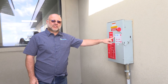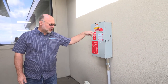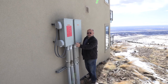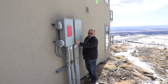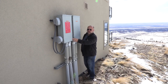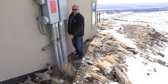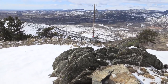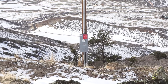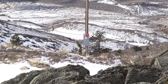This is currently a single disconnect for the entire system. As I mentioned, we're going to split this into two and put another switch here, then run twice down into the basement service panels. On the outside of the house you can see my two service drops, 200 amps each. These go underneath the floor into the utility equipment room. You can see the supply for these 200 amps each goes underground out to the pole. On the pole is my service meter — you can see the two services coming out of the bottom of the meter set and the transformer that was dropped for the home.